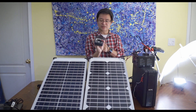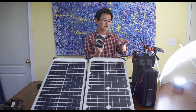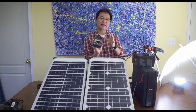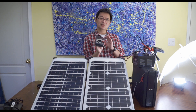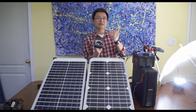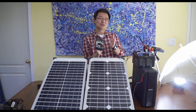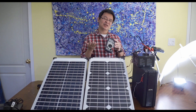You have to keep track and make sure it doesn't exceed 28.4 volts on these 24 volt batteries. Around 28 to 28.4 volts you should stop charging. This requires you to monitor it — maybe every half hour check the voltage. It's not ideal since you'll waste some time.